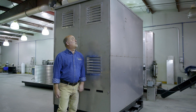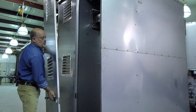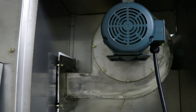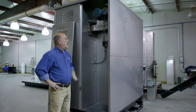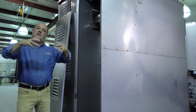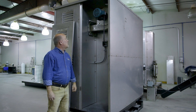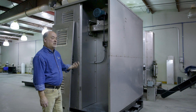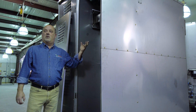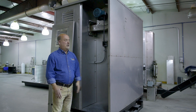Now we're at the end of the heat exchanger where we have a closet, as we call it, with an ID fan inside — a three horsepower ID fan. ID stands for induced draft. We've got the whole system on a vacuum or negative pressure, which means it's a lot safer because all the gases are being pulled inward and then out through the back. That yellow wire here is where we measure the temperature for the output. If your output temperature gets high, the computer will recognize that and start shutting your machine down, telling you that you need to clean your machine — so it's a nice safety feature.